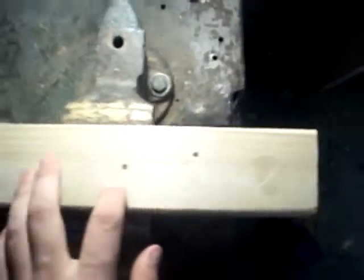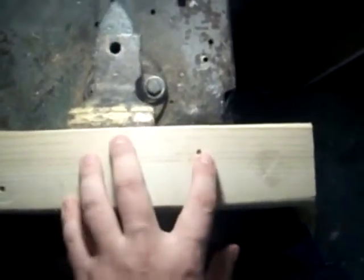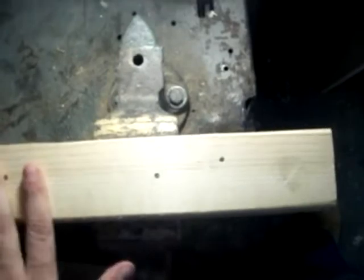In the final product, I'm not going to use any finish nails. I'll just glue it together, and I'll also shave the legs down with my hand plane joiner.